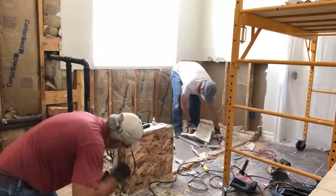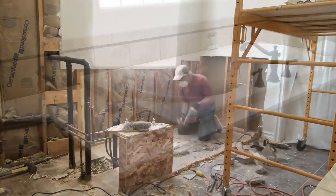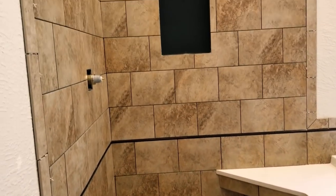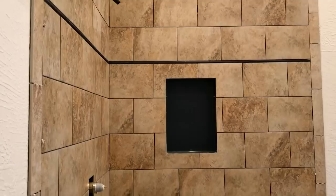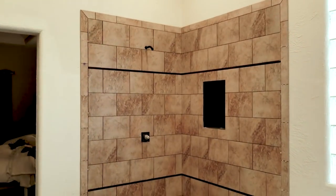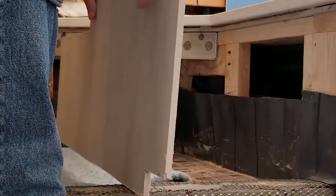What makes this a little different is that the lines for our tile stretch across both the tub and the shower walls. So we need to take into consideration where the tile starts and what reference lines we're going to be using to make all this turn out right. By taking a little time to think about this and plan for the layout of the tile, a lot of headaches can be avoided during the actual installation.